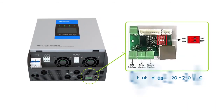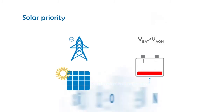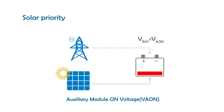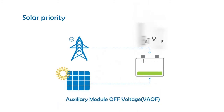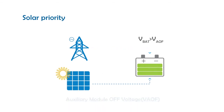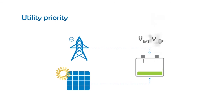Switches can determine the output voltage and frequency. UPower Series Input Priorities: Solar Priority is the default mode. In this mode, the battery is charged in solar priority, and when the battery voltage is lower than the auxiliary module ON voltage, the utility starts charging. When the battery voltage reaches the auxiliary module OFF voltage, the utility stops charging. Utility Priority: the battery is charged in utility priority mode, and when the battery voltage is lower than the auxiliary module ON voltage, solar starts charging. When the battery voltage reaches the auxiliary module OFF voltage, the solar stops charging.